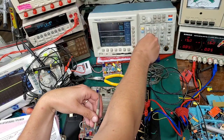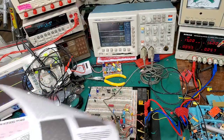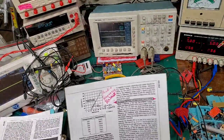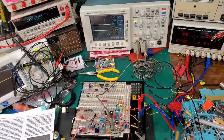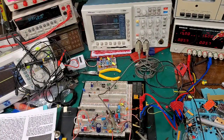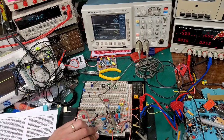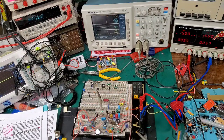Anyways, one thing: I didn't use any of the amplifiers. I wanted to know if I could do it without using the LF356s. I tried regular JFETs, DiFETs, BiFETs. I tried a couple CMOS amplifiers, BJTs, and they all seemed to work fine. The values needed to be changed a lot to allow those changes to be made.